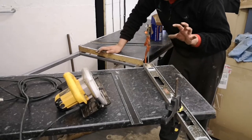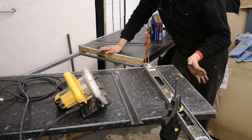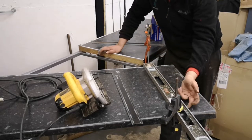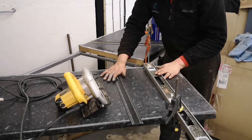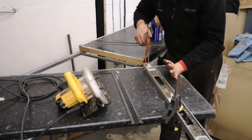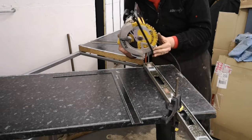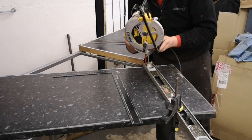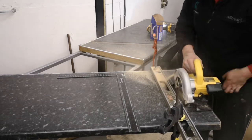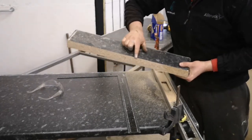The frame is now painted, and it's now time to cut the worktop. Now these are just off cuts of crap old worktop, they're in not the best condition, but for a workbench it's perfect. Now all I'd say is if you're going to use a circular saw, you want a nice edge to run down. So I'm using this aluminium spirit level and I'm setting it so it's 100% square using the big set square and some clamps. That way I know it's going to be absolutely perfect. Another top tip - you want to set your blade so it only just goes through the material. If you have it go through too far it can make it wander a little bit and it's hard to control. Hope you can see that's a really nice perfect cut, hardly any splintering.